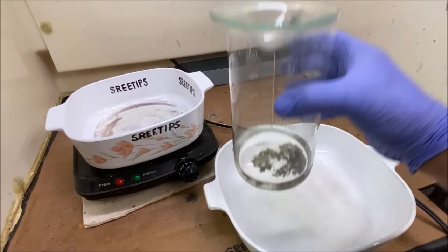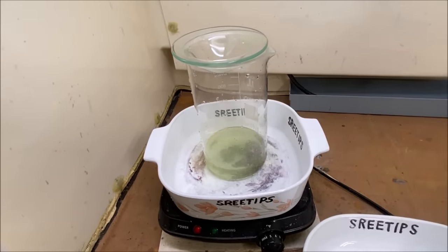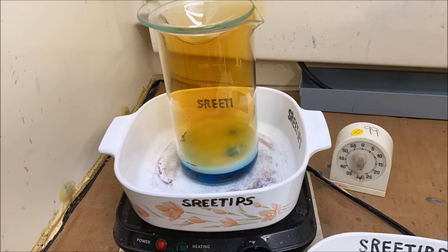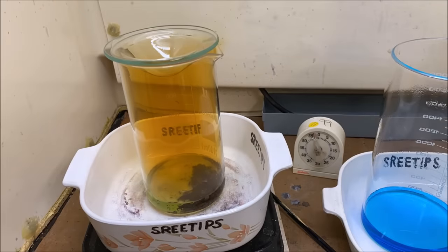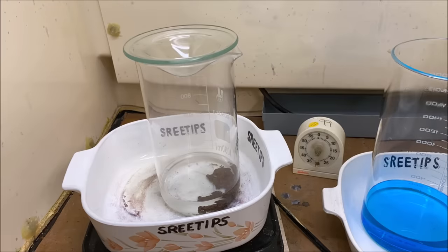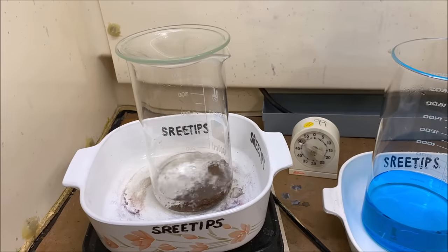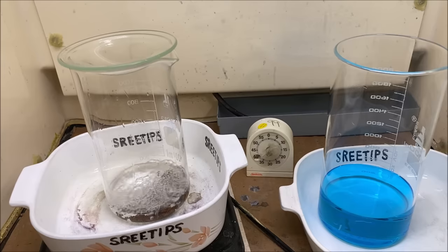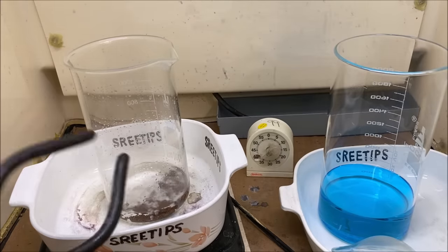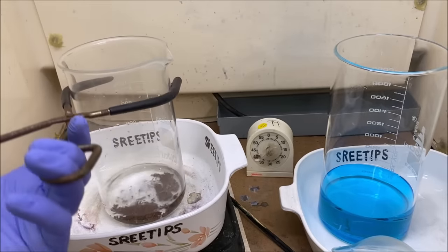Set it up on the heat. Here I'm doing 4 nitric acid boils on time lapse. What I'm doing is pulling the silver and the base metals out that we added when we inquarted the gold with the sterling silver. We have to inquart that gold in order for the nitric to be able to penetrate. And here you can see by the colorless solution that we've got all of it pulled out now. I can tell by the color, all the silver and all the base metals have been pulled out of this now. There's our gold. See how colorless the solution is.